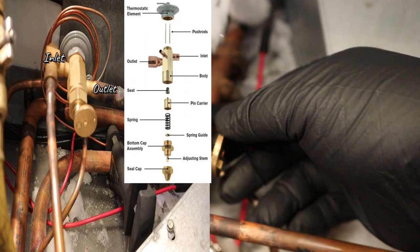I want to show this from my point of view and then the actual schematic inside of the TXV. When I'm adjusting that stem clockwise, I'm pushing all the guts in and pinching the valve — so I'm raising the superheat. When I'm going counterclockwise, I'm opening the valve, stretching it out, allowing more flow.